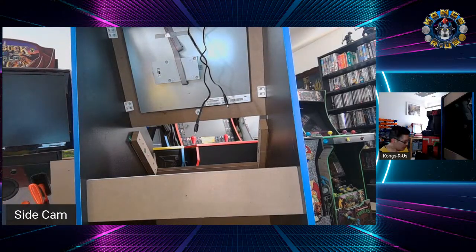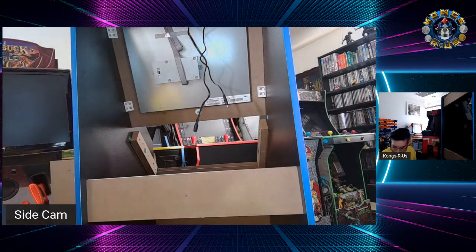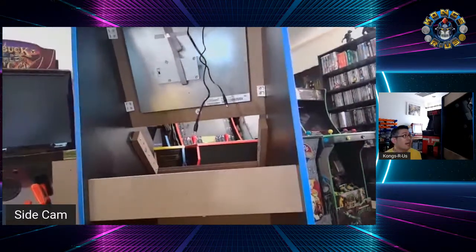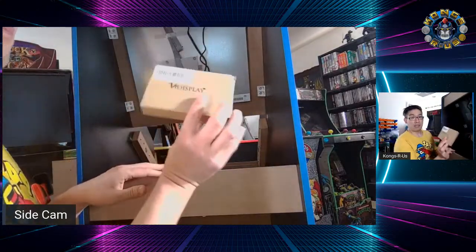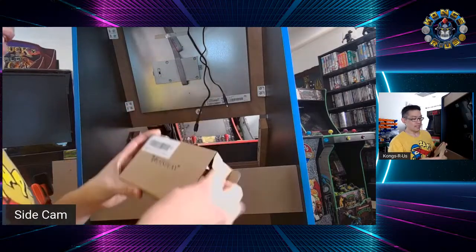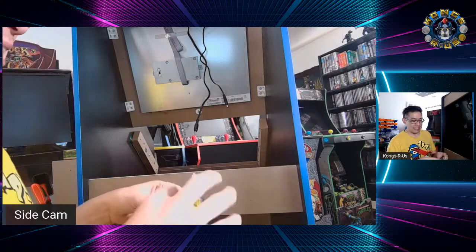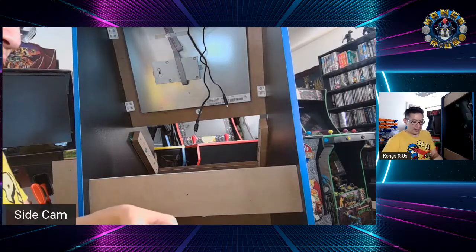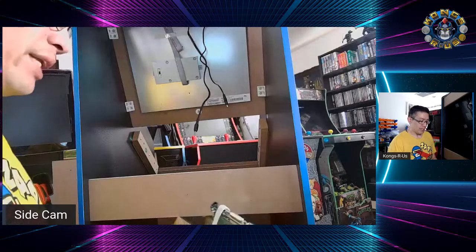So we're going to start with the actual LCD to HDMI converter to just show you what I do to put that together. This is the Gen 3 BOE monitors here. This is the display adapter that you're going to need. It comes in the kit, and you can get these from Amazon. The resolution for these is the 1280 by 960 boards, so make sure you're getting a Gen 3 version of these boards if you're doing this on your own.